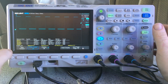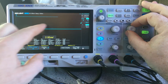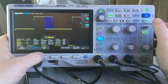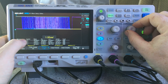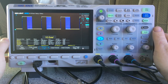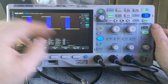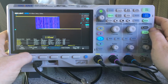Now I've got the board outputting a PWM signal to scope. You can see the glitching where the pulse width modulation is going on. I'll turn color gradient on — it stands out a lot more. You can see what's happening with the actual pulse width changing. I'll turn on persistence for one second and you can see the actual range it's running on. Those are nice features to have. I'll clear it so it refreshes.